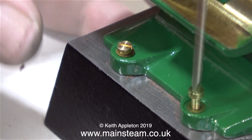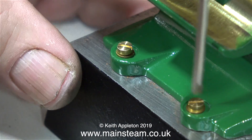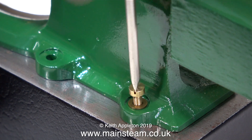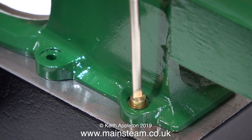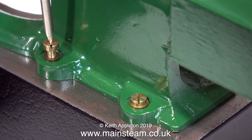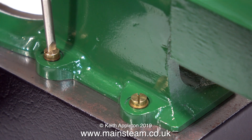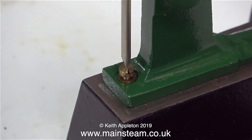Now for a bit of mass production - I'm bolting the engine onto the bed plate. A word of advice when doing a job like this: never tighten any of the bolts until you've fitted every one of them. This allows a small amount of tolerance for alignment of the bolts in the holes. If you tighten up each bolt as you go, you'll probably find that when you get to the last one it's not in line with the hole. Make sure you don't tighten all the bolts until you've finished fitting them all.